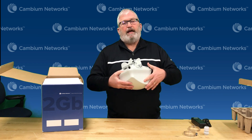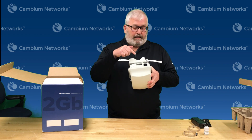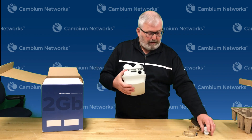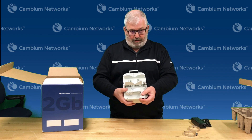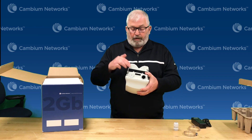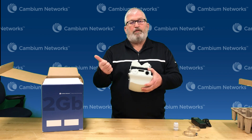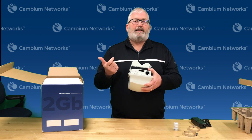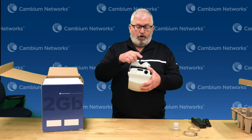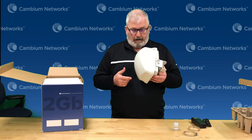It does this by having a 2.5 gigabit Ethernet interface. It has a POE in plus data port, and that's where the cable gland comes into play. I connect up an RJ45 connection to this first port. There's also an optional AUX port, and if I want to provide POE out, I can power a camera or an outdoor Wi-Fi access point, also with a 2.5 gigabit POE out — a really nice solution for connecting remote cameras and remote Wi-Fi access points.